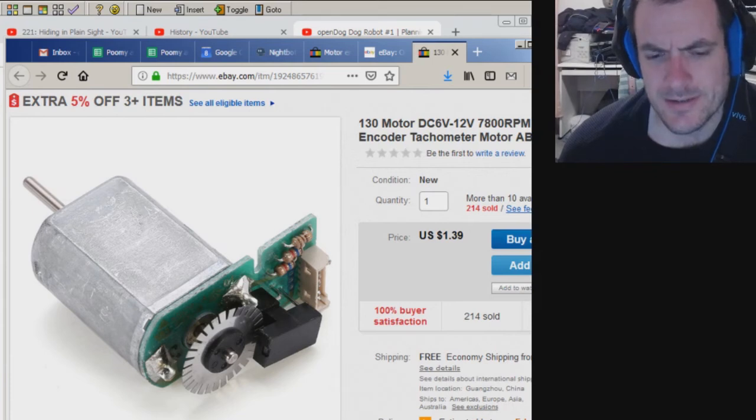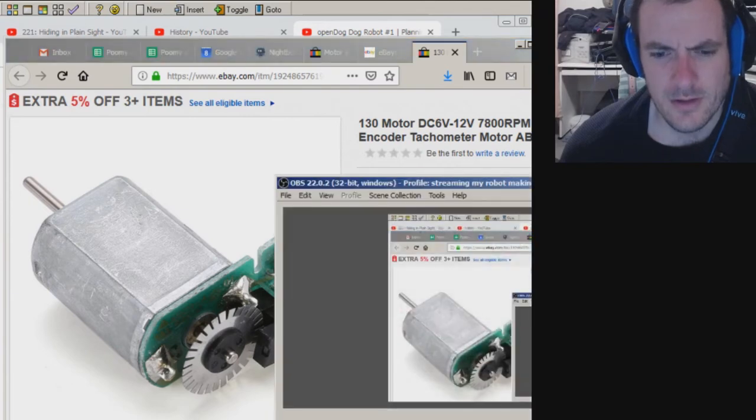No, not the Z axis, just the Y and the X I'm worried about. The Z is just the tool head. That can be done using a multi-turn potentiometer or something. But yeah, I just bought a couple of these, and that'll help a lot with my CNC machine to measure the distance traveled of the main axes. It's going to work great.